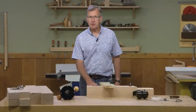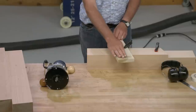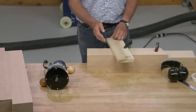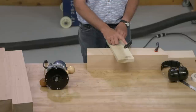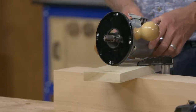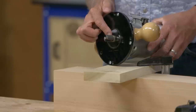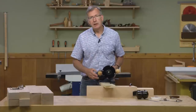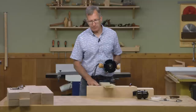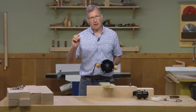To cut these lapped half-dovetail joints that join the long stretcher to the legs, I'm going to be using a pattern bit and a router. The setup here is that I have a reference piece of wood to act as a fence, held with double-sided tape and a clamp. The pattern bit has a ball bearing on top of the cutter that will ride against this fence. Since we need to cut a very deep lap joint — one and three-quarters of an inch deep — I want to do that in several light cuts, with the first cut only about three-eighths of an inch.